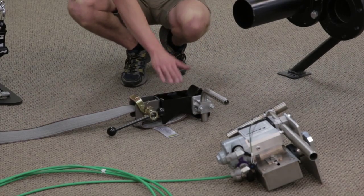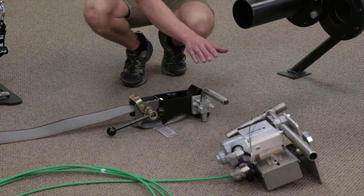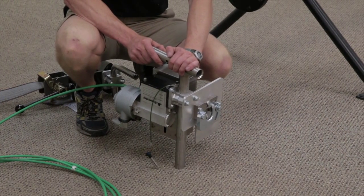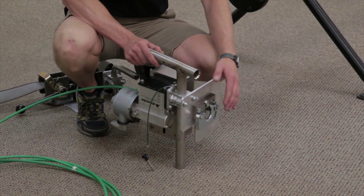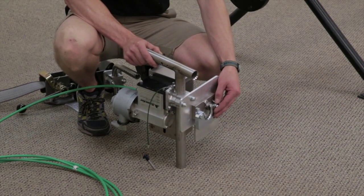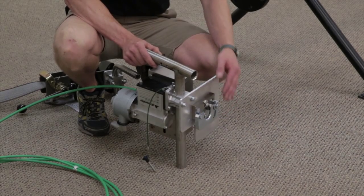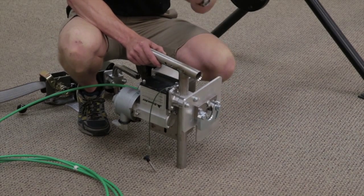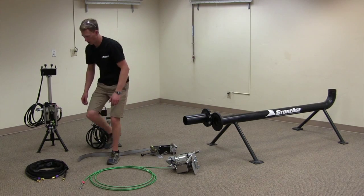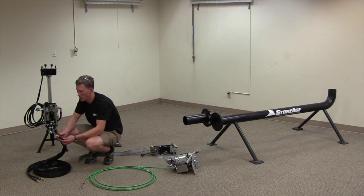The pipe clamp attaches to the helix drive. The helix drive has a mating pipe to the pipe clamp, a back-out preventer which stops the tool or stops the hose on the tool, and also a splash guard to prevent any jets from exiting the pipe.